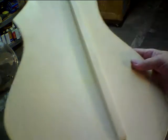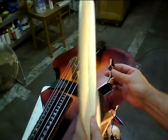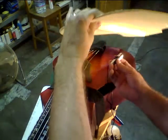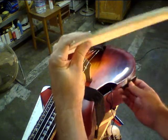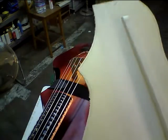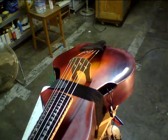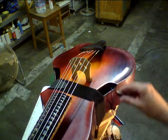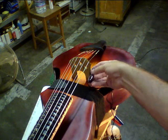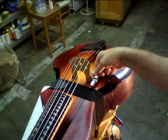This is what the bass bar looks like on the inside, and there's a flat area here. We're going to take this pickup and stick it right on there from the inside — it's a little tricky to do if you don't have the right tools, and we'll talk about ways you can improvise. We're going to get it right underneath and in the middle, so this little round thing is right underneath the foot of the bridge — just kind of stuck right there.